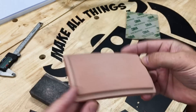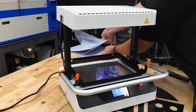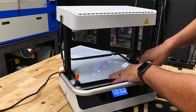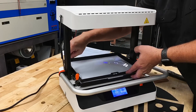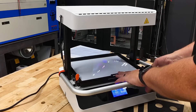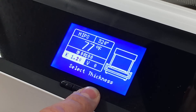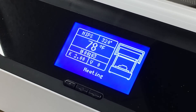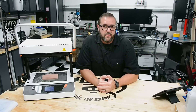With the buck ready to go, the next step is to take it over to the VacuForm. Preparing the vacuum form, I place the material in the tray ensuring it covers the seal entirely. Placing the top clamp, I adjust it so that the front lifts about a quarter inch, ensuring compression of the seal against the material as it's clamped. Raise the plastic to the heating element, where it's held by magnetic force. Configuring the vacuum form, you select the material and thickness, and then start the heating process. Depending on the type of material and thickness, this time will vary, but the machine will let you know when it's time to pull the mold.